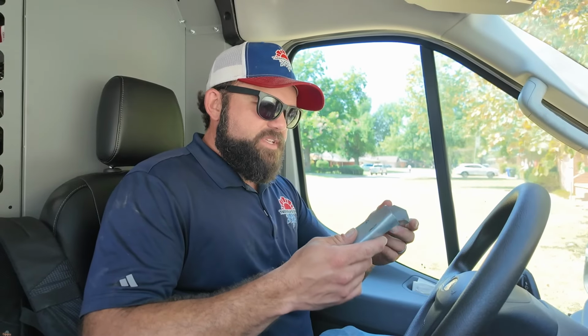Overall, this first time maintenance went pretty well. Most times they go pretty smooth without hassle. You may have a few recommendations here and there, but today, we found these two pieces of metal that had been wedged up to keep the heat exchanger tubes from flapping, I'm assuming. Or they don't even flap, it's just a light vibration, but metal on metal can sound like a real screech to the homeowner. So we pulled those out, we let the blower run at full speed. We could hear a little bit of that, but we'll have some recommendations for them.